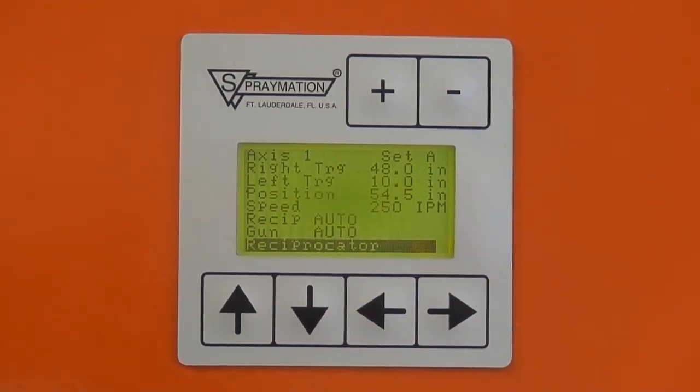And we're back to where we wanted to be. Now, since we did a test, the machine is going to have to return home and then do a painting cycle. So I'm going to push start, and you can watch the display as we do a painting cycle. The finding home speed is 750 inches per minute, half the maximum.